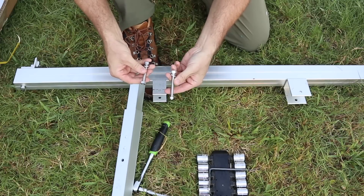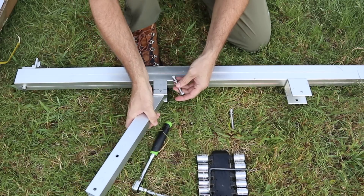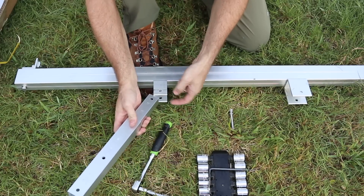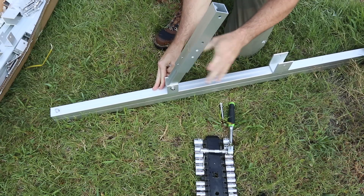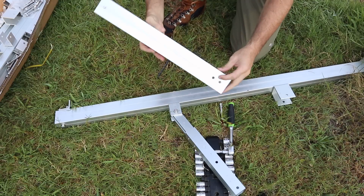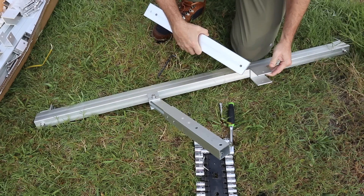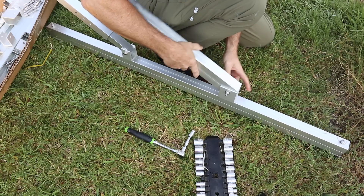Now we're going to take one of our medium length bolts and one of our short bolts. The short bolt is going to go for the bottom adjustable arm right here - put this skinnier portion in the small bracket. Don't tighten this all the way because you're going to need to adjust it when we get it on the foot bracket on the concrete base. Then we have this other short beam with two holes - the one at the top goes in the large bracket on the arm assembly. Don't tighten this one fully either because you're going to need to adjust it.